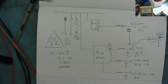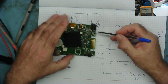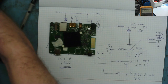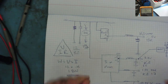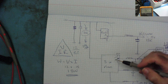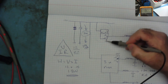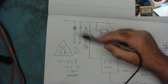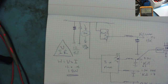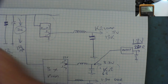So now let's do it. First of all, I'm going to remove the chip and see if it's gone. If it hasn't gone, let's stick 12 volts in, and then let's see where it is. Just before the sharp-eyed ones of you mention this in the comments section, yes, the low resistance could be in this chip. Yes, it could be another capacitor, and yes, it could be this one. Now let's remove that and let's have a look.